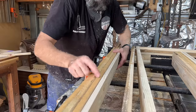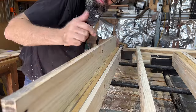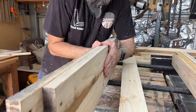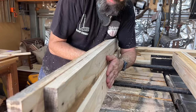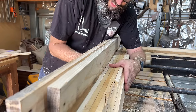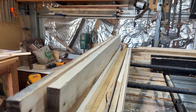I've got the thick slats, I've got the thin slats. This is the size stock I want to use. Now, two thins is greater than one thick. Three thins is about the size of two thick. But then the kerf of the saw blade, that would be too small again. Four thins, there's probably too much waste. So I think the safest bet, laminate all the thin slats together and then just resaw them into the thick slat. Whew, that wasn't even confusing.